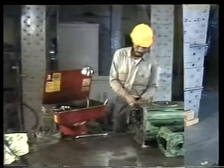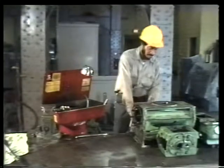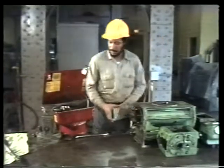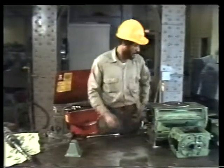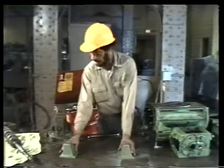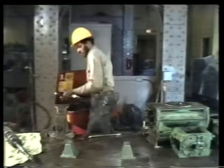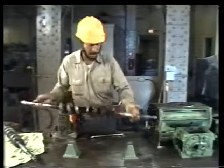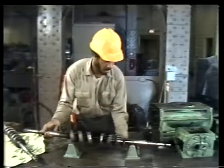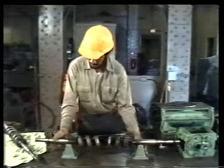When you're finished with the second rotor, you'll want to inspect both of them. Set up a pair of V-blocks with enough space between them so that you can suspend one of the rotors over the table. Next, take the rotor from the cleaning tray and position it on the V-blocks as you see here. What we're going to do here is take a runout reading.